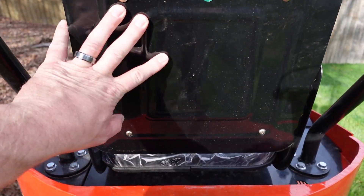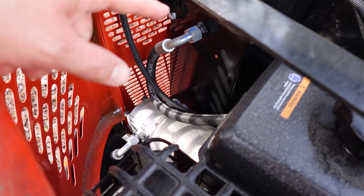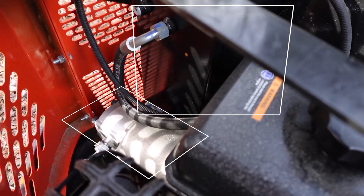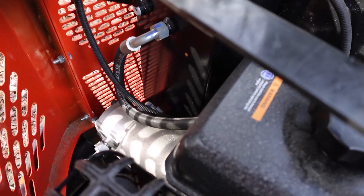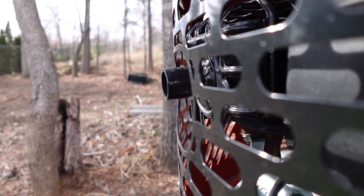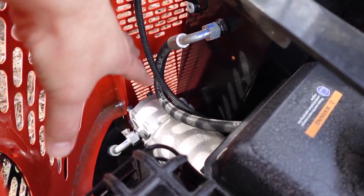Let me show you the real estate we have to work with on this machine. On the WH12R, the left-hand side of the engine bay is primarily occupied by the hydraulic tank, which runs from the top all the way down to the bottom. Immediately behind that is the hydraulic pump, and then the engine. There's really no option anywhere on the left side to mount this fan. There's a curved grate on the back, but I don't want to pull in hot exhaust gases — I want ambient air. So the left hemisphere is out of play for this 10-inch fan.